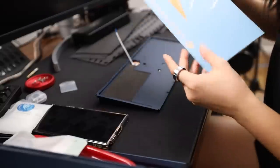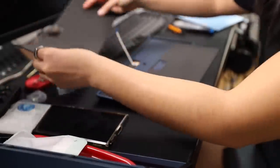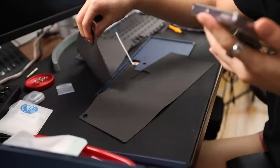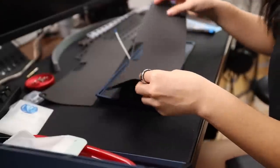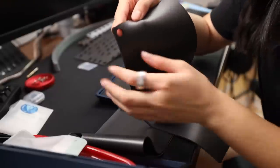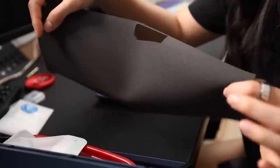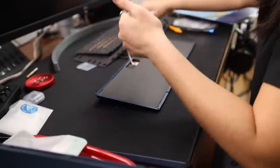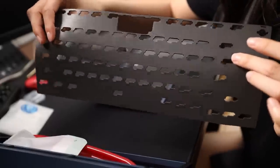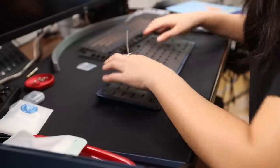Next step is to put poron foam — case foam — in as necessary. There are two options: a thin version (1mm poron) and a thick version (2mm poron). The battery room is 3mm poron. I'm going to go with the thick one. Foam selected — this thin one's going into the unused pile. And then there's another one that goes on top of this, but below the PCB — the one with all the little tiny holes.